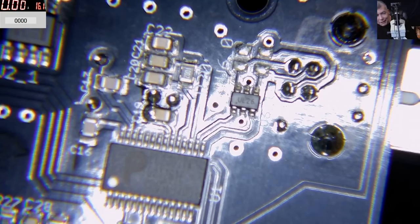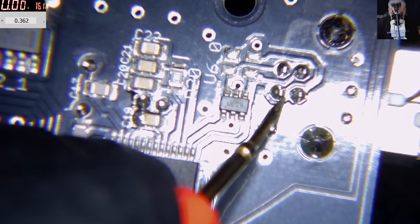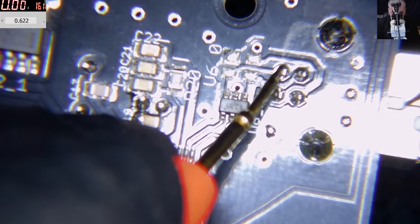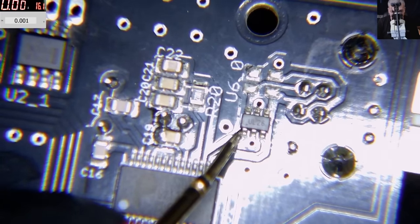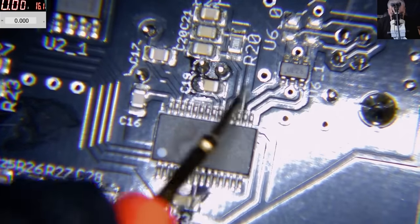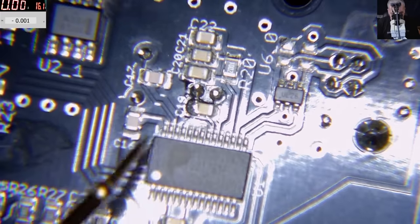It's just strange. Okay, let's see. On the USB communication pins, they're 5 volts, and we have 5 volts here. There's 0.6 here, 0.6 here. Okay. Then it's coming to a small chip, and then to the chip. I can't see anything wrong here. Let's see the power supply of this one. So this must be some 0.7. Okay, what about on this capacitor? Oh, that's a crystal there.